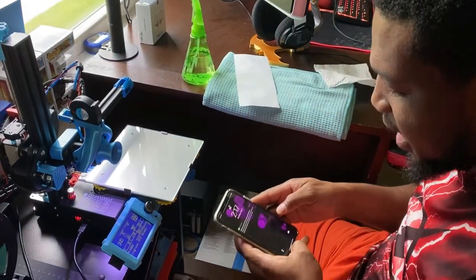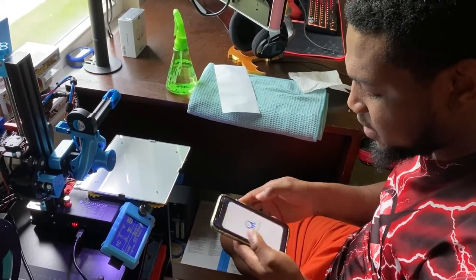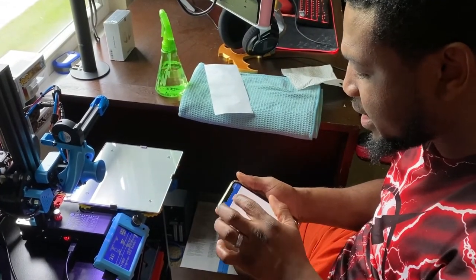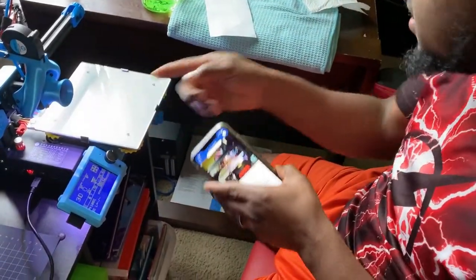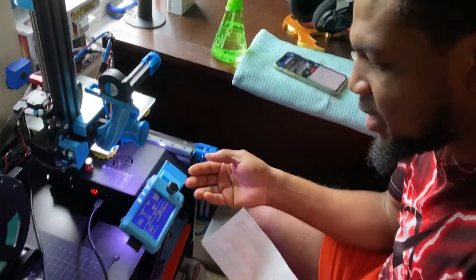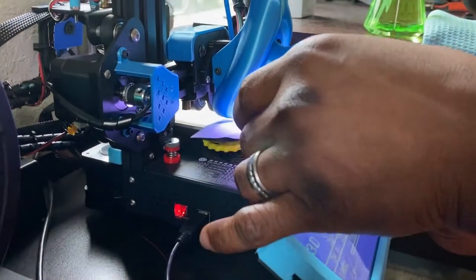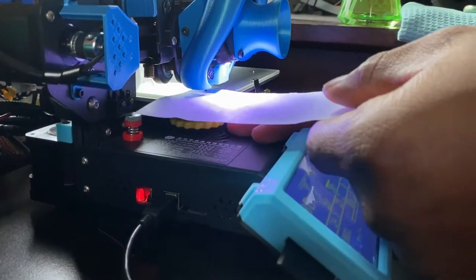I'm using a Raspberry Pi 4 with 4 gigabytes with this printer, and I have an application called OctoPanel to manage all my printers. I have a custom G-code for this bed specifically. I'm going to go ahead and start leveling all four corners first. The printer is moving to position. You can use the LCD screen to level, but I find it easier from my phone. I'll put this paper in now — it's the perfect thickness for this.